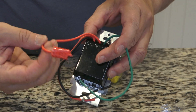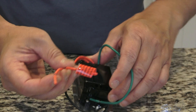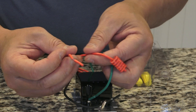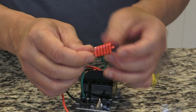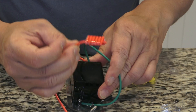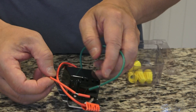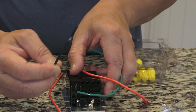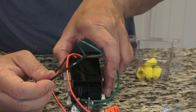In the back you have four wires coming out. The green wire is the ground wire. You have two red wires — since I'm replacing a single-pole switch, we're only going to use one of the red wires. The one that's taped up is for a three-way switch, so we're not going to use it today — we'll just cap it off and leave it alone. The black wire should be connected to the live wire coming from the circuit breaker.